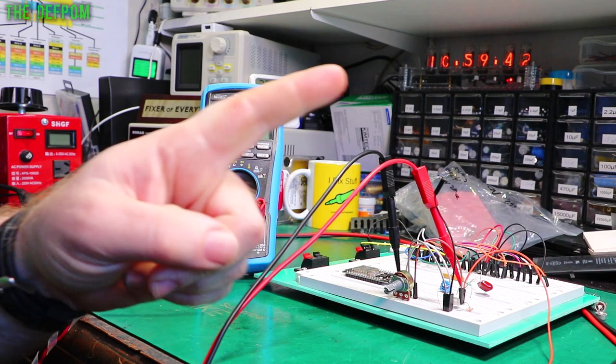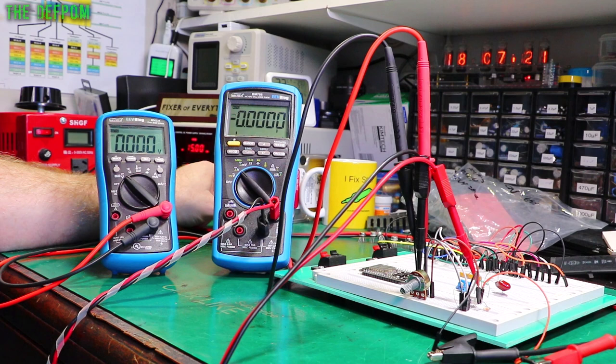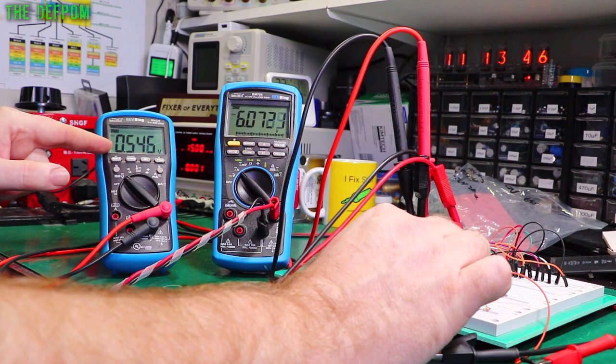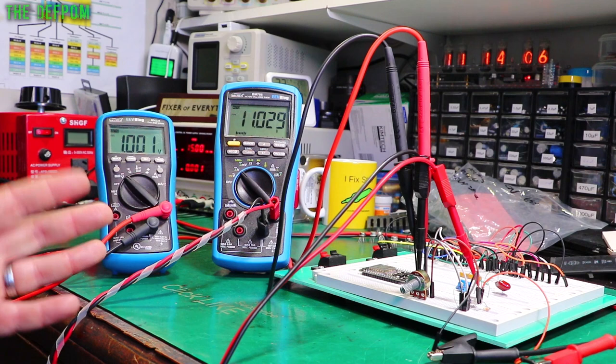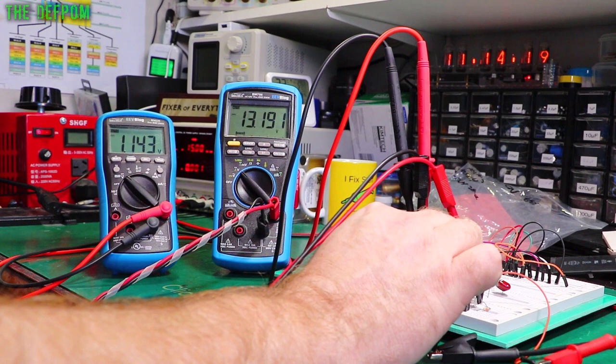First device is installed, let's give it a try. We've got a 4.8 volt output offset. At half a volt input we're getting about 6 volts out, 0.9 volts input gives about 10.5 volts out, and 1 volt on the input gives 11 volts out — roughly 10x gain as expected. Maximum output is 14.2 volts, so about 0.8 volts down at the top end, and 5 volts offset at the bottom end. Device number two gives a 4.1 volt offset, about 11 volts out at 1 volt input, maximum 14.3 volts.